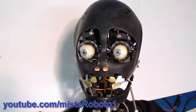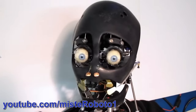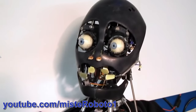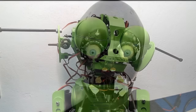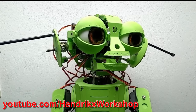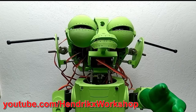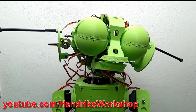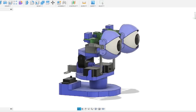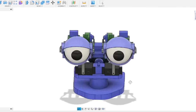I've recently been watching animatronic videos on YouTube. There are lots of great mechanical assemblies for heads, hands and other types of creatures built with 3D printing and other techniques. If you've ever built a project using RC style servos in Arduino, you know that it's really very easy to move servos around using the Arduino servo library. But you'll find that the servos start suddenly, move to their new positions as quick as the motor will go, and then stop suddenly again. This can be quite noticeable and it can make the project look less organic. So today I'm going to show you how to make servos or other actuators move much more smoothly using only two simple extra lines of Arduino code.